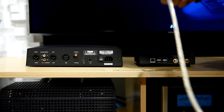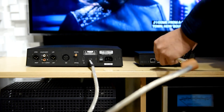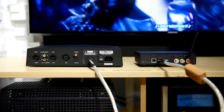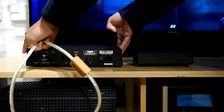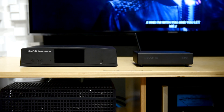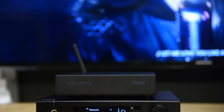Finally, you can plug a DAC into it via USB. If you have a very good DAC and want to add streamer functionality to it, you can use the Primo for this. Some might say you can do the same with the Bluesound Node 2i using optical or coaxial, but some DACs — like the Matrix Mini Pro 3 — require USB for MQA. If you plug the Matrix Mini Pro 3 to the Node 2i via optical, you will not get MQA. So if you have a high-end DAC that needs USB for MQA, or you know your DAC sounds better via USB, you would choose the Primo as an add-on streamer.